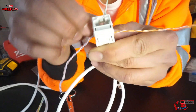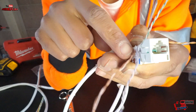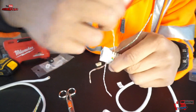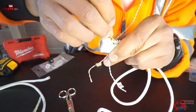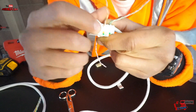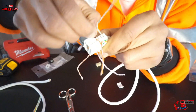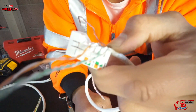Then you go on to the next one and do the same, but now it's brown. Give it a couple twists — brown and white-brown. Now you go to the orange one, give it a couple of twists. Solid orange and white-orange — make sure you read the color from the side. Then you go and untangle a little bit the green one. White-green and green. We're almost there. Now that you have the coloring in place, you double check it, make sure your work is right.